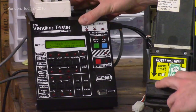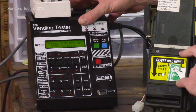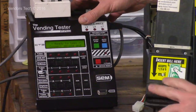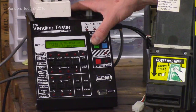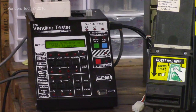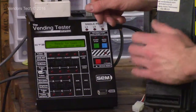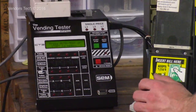At certain times you're going to be connecting something to this tester, let's say a bill programming module for these MEIs, that is going to update the software and upgrade it for new bills. If you just connect it, trying to get it to connect on MDB, it's not going to connect. All that programmer needs to connect to the bill acceptor is power. In some applications, when you're doing things like calibration, updating, or tuning on CoinMechs, all you need is 24 volts or 110 volts into the device.